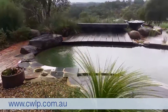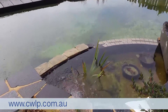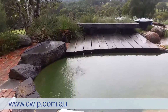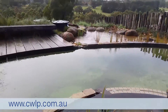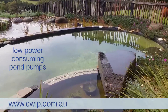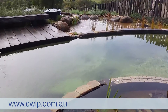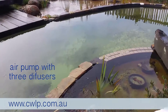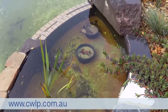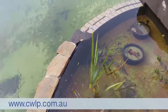He's taken that advice and created a beautiful pool. You can see here the equipment that we've used — including aeration. We've changed from traditional swimming pool equipment like sand filters and big power-hungry pumps to low-power-consuming pond pumps. There's basically just one water pump running this, and an air pump with three diffusers located at different points. One is in the spa combined with some filter media underneath — layers of zeolite — with aeration providing circulation.